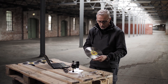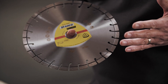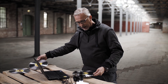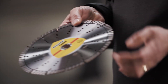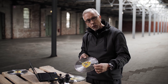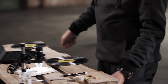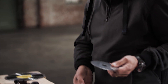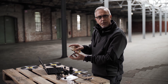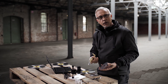The next most integral part of the wheel is the steel core. There's a huge difference in qualities of steel cores regarding thickness and also the design. This example here has built-in cooling holes. We can change many things on the design — the width of the gullet makes it very close or very wide. This example is like an economy type wheel, 1.2mm in thickness for the core, which is okay for very light work.